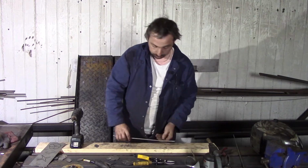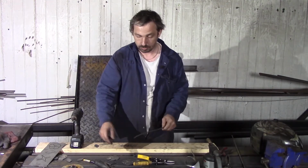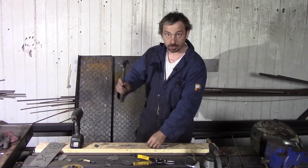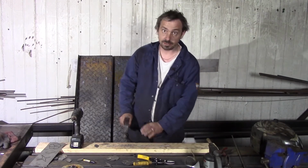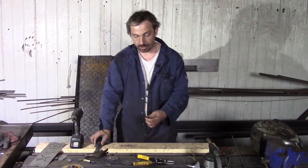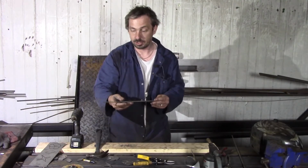How did I get this? I just cut a piece from this one. And again, somewhere on some steel beam or wherever you want, with the same hammer, put it on the floor and just bang on a random principle, some one here, somewhere it's a bit flattened, that's nice, that's fine, that gives a more realistic effect. After that, turn it a little bit and bang again in a different place, and you finally get a bend like this. You can see by eye when it's complete enough. I spent approximately half a minute and I got this shape.